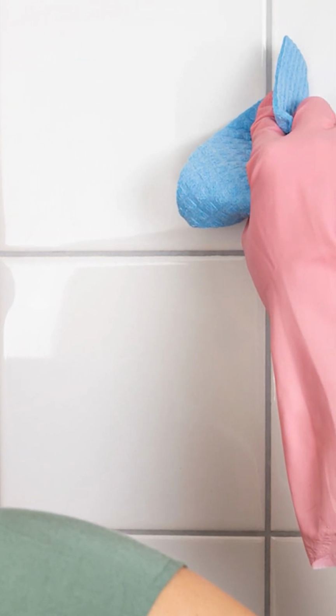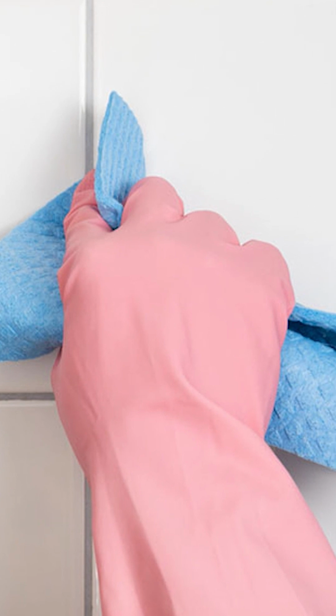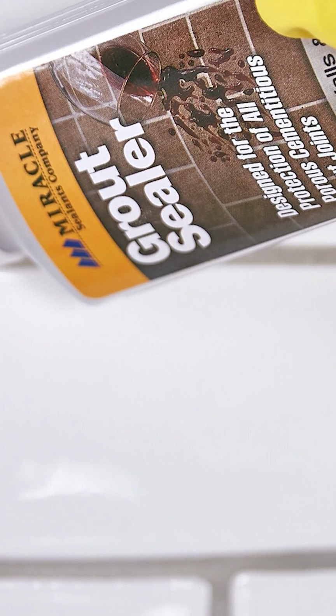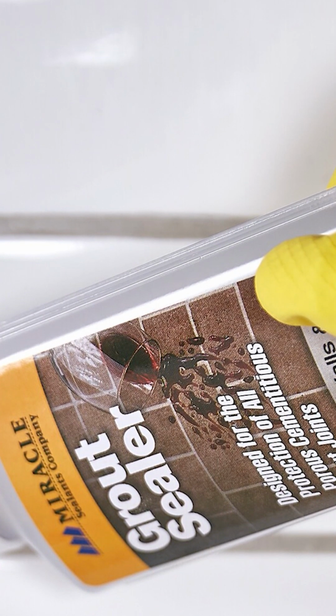These materials work well with vinyl adhesives, but the same can't be said for grout. You need to ensure that all grout lines and vinyl seams are scrubbed clean with an abrasive sponge or brush. We suggest adding a fresh coat of grout sealant. This will give the adhesive a better surface to adhere to and also make a cleaner removal in the future.